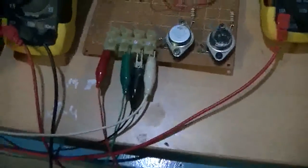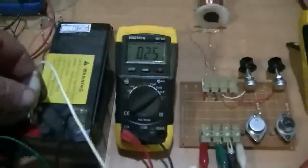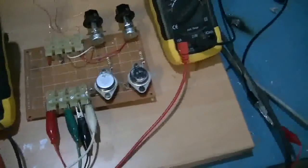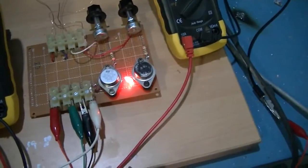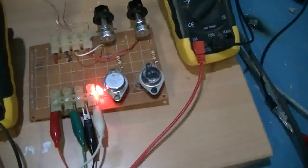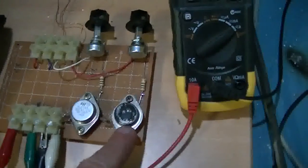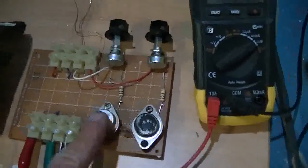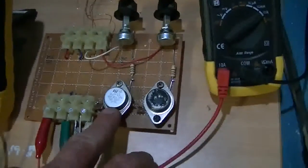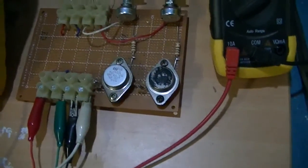On a normal SSG or solid state circuit, if we disconnect our charge to the positive charge battery, our neon will indeed come on. And the one going to the negative of the other charge battery — you'll see the neon on the other side comes on too. So both of these batteries are charging off of this one battery. We only have the one coil — one side going to the collector of this transistor and the other side going to the collector of that transistor. So we're collecting both the positive and the negative side of the collapsing coil, instead of just the positive.